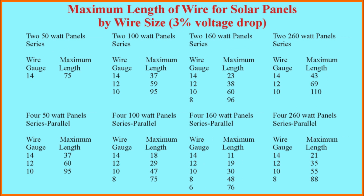Okay, here are the results for 2 panels wired together in series, and down at the bottom 4 panels wired together in series parallel. So these are all the common wiring configurations that you might use to get up to 4 panels together in your solar array. Again, this table is in my blog post, and the link to that blog post is in the description for this video.